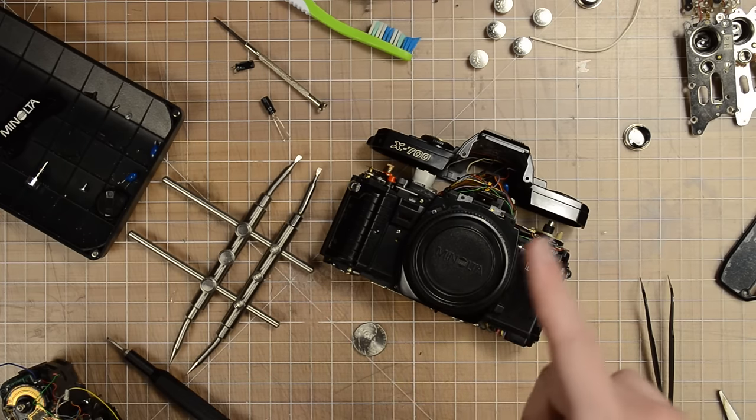I start out by going in with a light dust coat, which I then flash off by blowing just air onto the part. This creates a somewhat rough texture on the part, which allows the second coat to go on heavier and promote better adhesion. I let the polycrylic dry overnight before sanding out any of the dust that had settled into it — and there was a lot of dust.